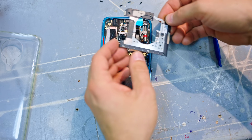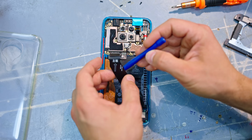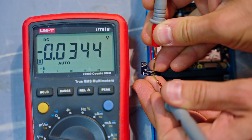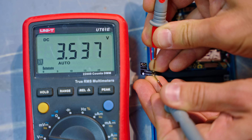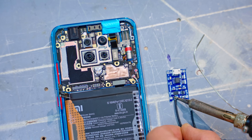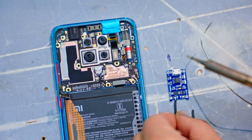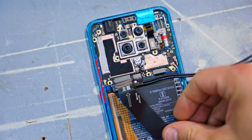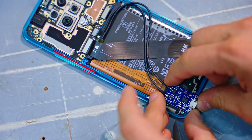The back is already off, so all I have to do is take off the plastic shroud and unsnap the connectors like little Legos, and then solder a little lithium-ion charger PCB directly to the battery terminals on the back. If you're going to attempt something like this, please make sure you know what you're doing or ask someone who does, because shorting out or damaging a lithium cell like this can go catastrophically wrong pretty easily.